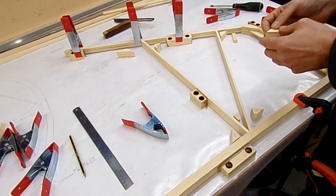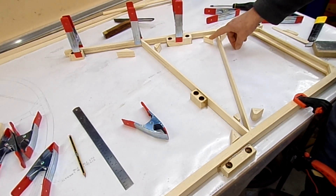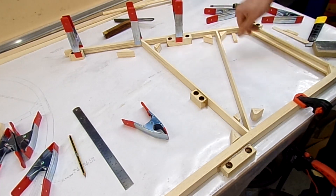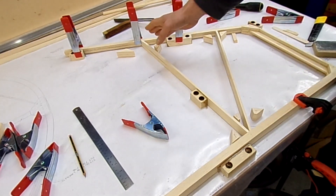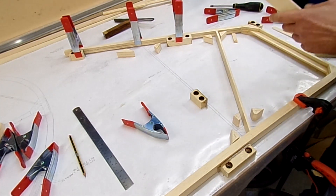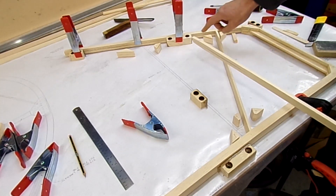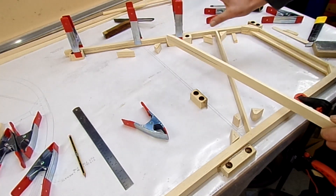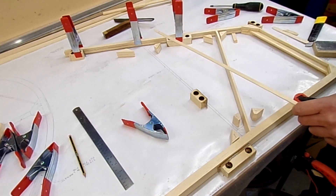I've redrawn the centre lines — they're all marked up and I put letters on. The annoying factor is the two here are not at 90 degrees so I had to make them individually. When you first look at it you think it'd be a 90 degree joint but it isn't. I've got all the ribs cut with their appropriate tapers on, marked up with the centre lines. The leading edge has been set up so the centre lines on the ribs match up with the centre line on there, so that's at the correct height and it's clamped to the block so it will stay where it is.